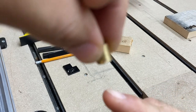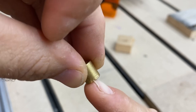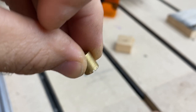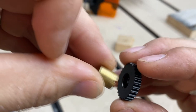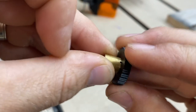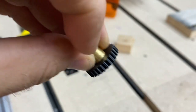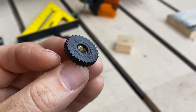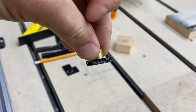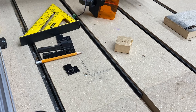The way to remember this: if you had to get a flathead screwdriver in there because it was stuck in your laser, you'd have the notches down. So we take those notches, line it up with our focus ring, and just thread it on. It might be a little tricky — there might be some paint in the threads — but you can see there's a little notch. This will thread into your laser. For the G2, G7, and G8 lenses, that's how we do it.